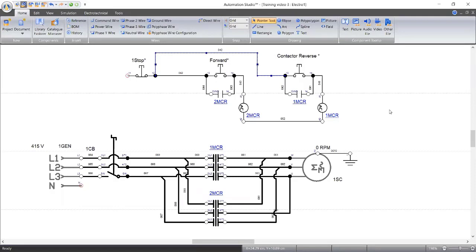The problem, you remember, we all did what we call transient. Transient is a split second. It has to do with switching. What happens within those split seconds? You wonder if this one starts, it will deactivate this one. So from what you're saying, basically, one will start before the other stops. It has split seconds. Yes. So that means there is a possibility that for a few milliseconds, the two contactors will be on.